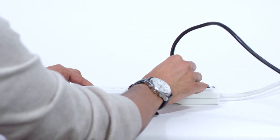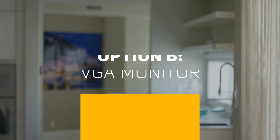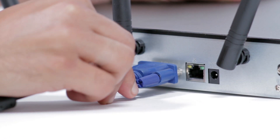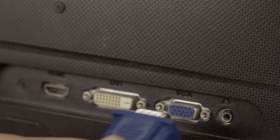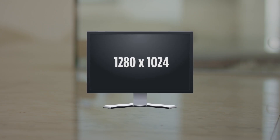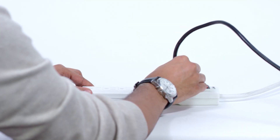The other option is through a VGA cable. Option B: VGA monitor. Plug the VGA cable into the NVR's VGA port and connect the other end of the VGA cable to the monitor. A 19-inch monitor or larger is highly recommended. Now, plug the monitor into a surge protector.